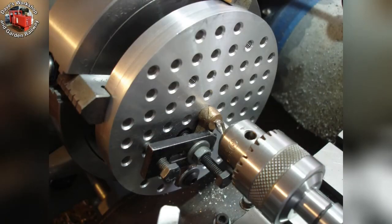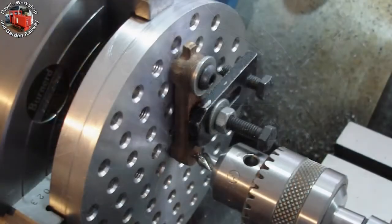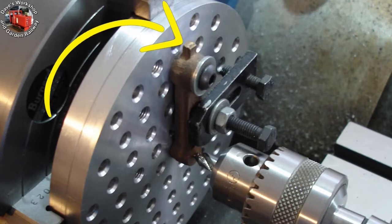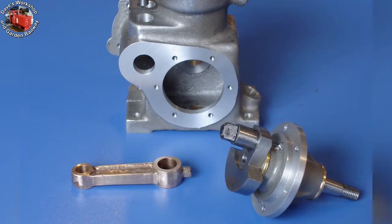Here is the cast bronze connecting rod, mounted on another of the Uni Mat 3 aluminium faceplates. The big end hole had been previously machined 30 years ago. Now it is the turn for the small end — centre drilling using the Uni Mat clamp. You can see the cast oil-lifting spigot on the big end. The conrod has been fettled all over, mainly with my Ryobi Dremel.